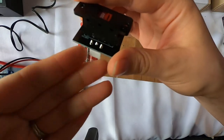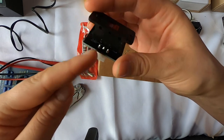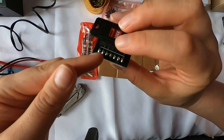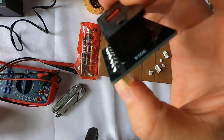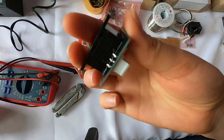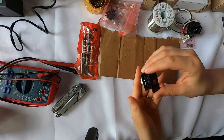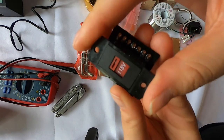And as I solder, I was pushing down on these elements here so that we had a tight connection once they were soldered in. I did the outer ones first, and then I filled in the middle ones so that this element would be attached as I was filling these in and I didn't have to push in as hard for the rest of them. You want to make sure you have solder all the way around the connection point, that you don't have overlapping solder. I don't know if this is focusing well. And since I'm in the US, I'm now gonna flip this over to a 115.